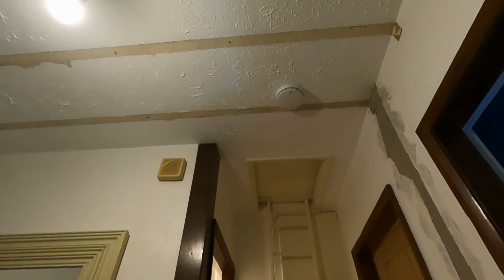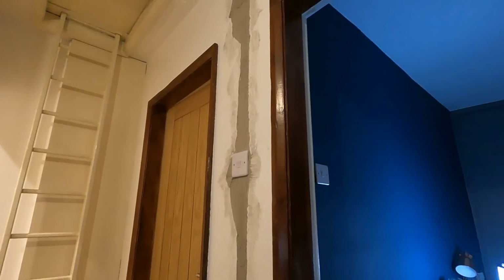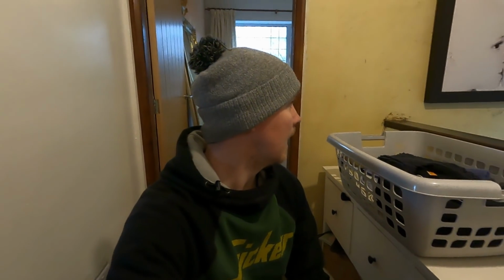And then a bit of testing, and then we're done, because there's only 5 circuits. There's down sockets, up sockets, down lights, up lights, and mains powered smokes. In the preparation, knowing the loft's going to be done, we ran a 2.5 circuit up to the loft, already done up this channel here. We plastered everything so it could all be used safely.